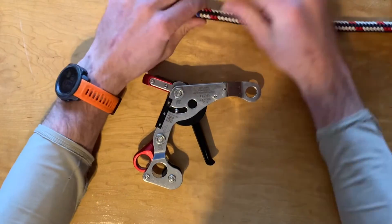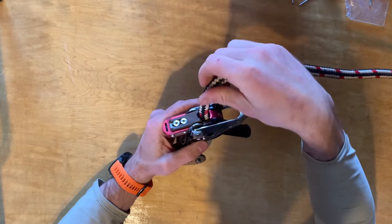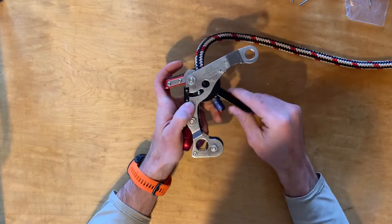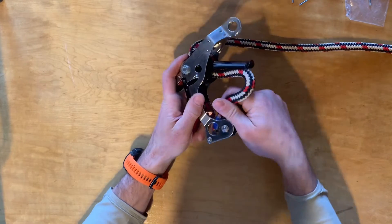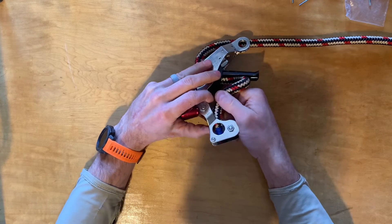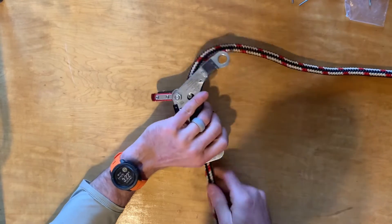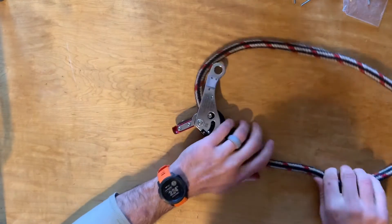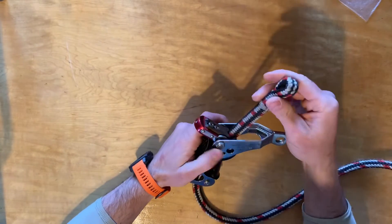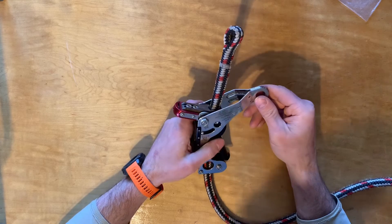Loading the Spider Jack 3 is pretty easy. The rope goes in between the wooden thumb brake and your friction clutch — there's a nice chamber that the rope will fit through and it'll pull through very easily. Then get into that fairlead pulley by going in between this stopping pin and the fairlead pulley. You gotta load from the bottom of your rope, then pull the entire length through until your eye is at the top. The eye won't pass through, so that's why you feed from the bottom.